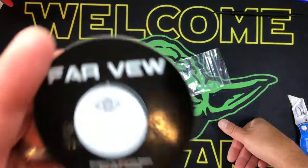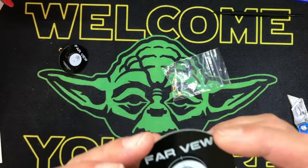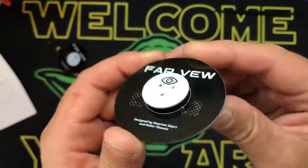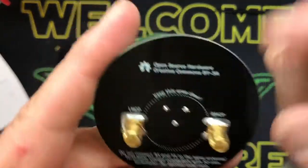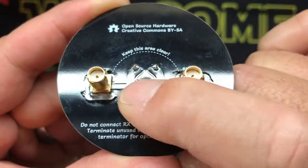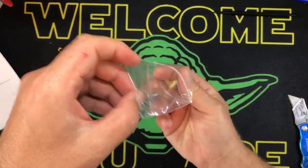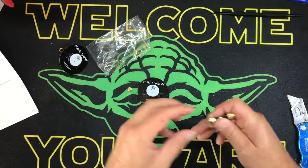I pre-ordered two of these about a month ago. These are called a triple-feed patch - it's a left-hand and right-hand circular polarized antenna. This is all that came - open source hardware, creative commons. You can screw it on lefty or righty, and then you get a 50 ohm terminating resistor. This kills whichever side you're not using so it doesn't dilute your decibel range.